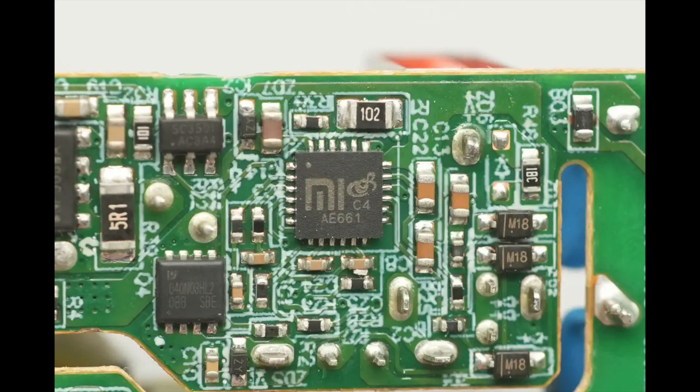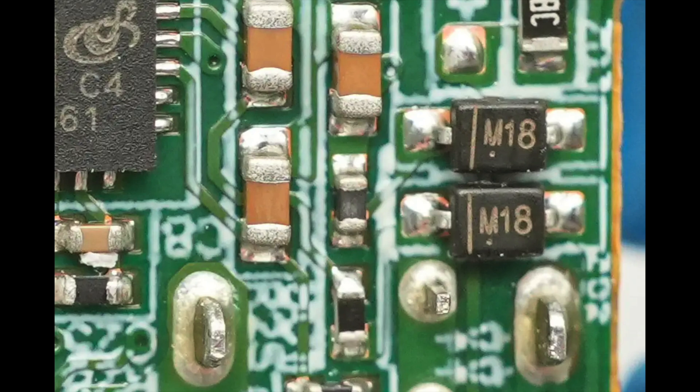The chip includes an internal LDO, a V-Bus MOSFET driver, and V-Bus discharge circuitry. It features a built-in 10-bit ADC for voltage, current, and other parameter measurements, and supports line-loss compensation. Internal temperature monitoring is included, with the option to connect an external NTC for ambient temperature detection. It also supports I2C communication, optocoupler feedback, as well as AC voltage and load detection. The package type is QFN24. An NTC thermistor is located on the right side of the protocol chip to monitor the internal temperature of the charger and provide over-temperature protection.